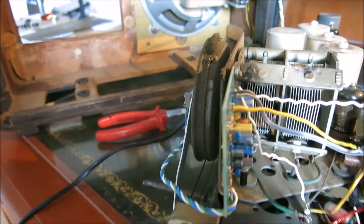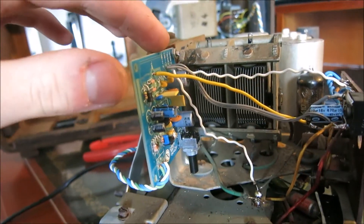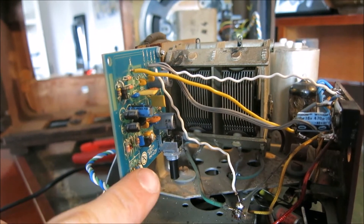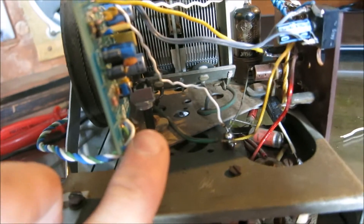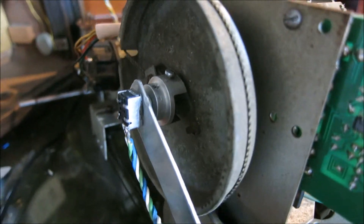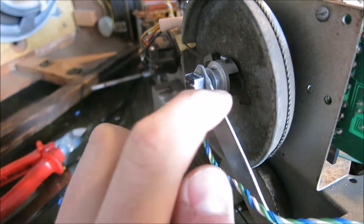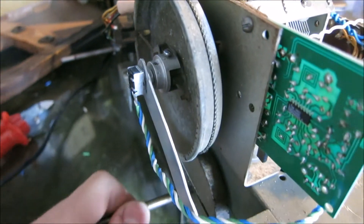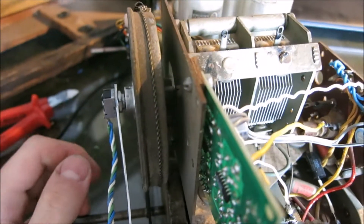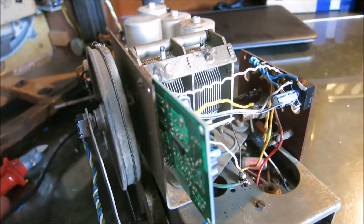The last thing — you don't have to, but I did it. Usually the frequency this thing receives is controlled through a potentiometer right on the circuit board. What I did is put three wires on it and mount it to the front of the big tuning capacitor. I machined a little carrier which is screwed onto the plate of the big capacitor and mounted with a little screw onto the potentiometer, so as I turn the dial, the potentiometer turns as well. Lucky coincidence: this thing makes one half turn from open to close, and this swing does as well, so I don't need to miss any frequencies.